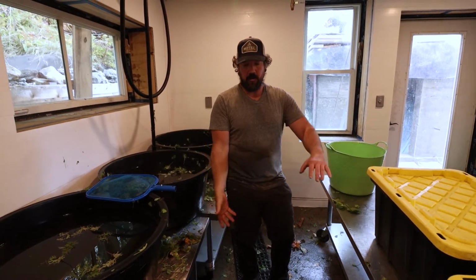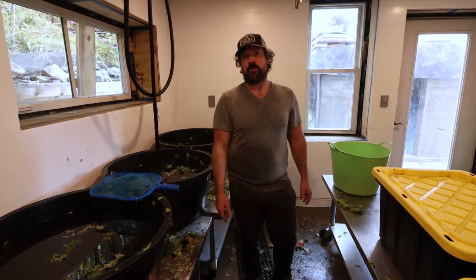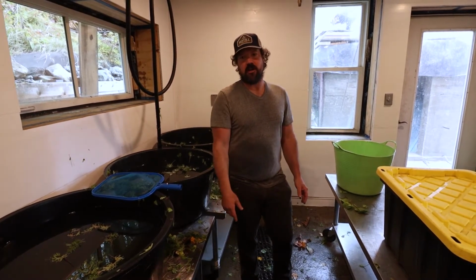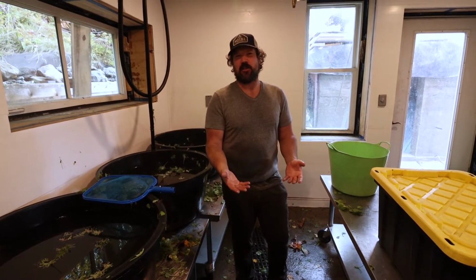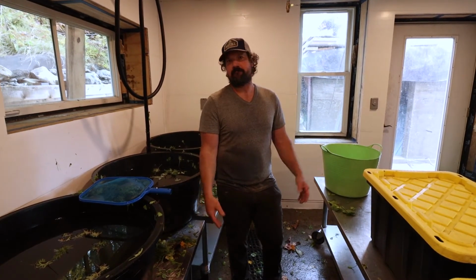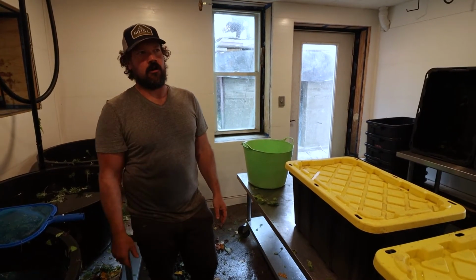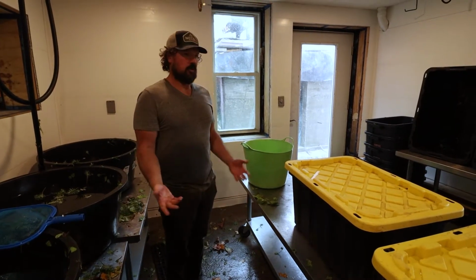That's just like a concrete box, and about 4 inches up from the bottom of that box, a culvert goes out, and that's where our drain water leaves. So we've been pretty happy with that. Pretty much no maintenance. I have pulled up the drain covers this summer, and they haven't even needed to be cleaned, because we're washing greens, there's a really high percentage of water to everything else. And then we have rolling racks where we can dry our post-harvest containers in here, and that's a really helpful part of it.